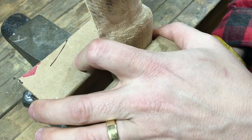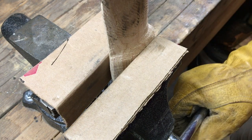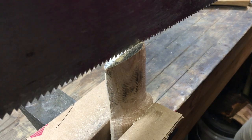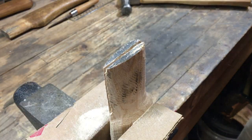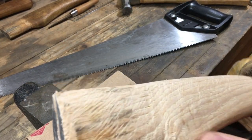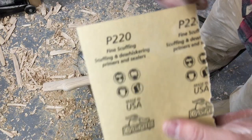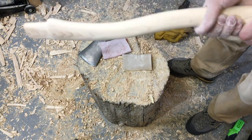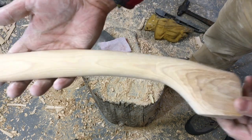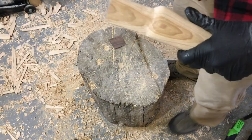After scraping it, it was time to cut the kerf cut for the wedge. I clamped it in my vise and went at it with a saw. It's important to try to keep this as straight as possible so that it lines up with the center and follows flush going down. I have in the past gone a little crooked on one side or the other, and it ends up affecting how the head sits on the axe. If your kerf cut slightly goes to one side, as you pound that wedge in it will turn the axe head away from that side. So it's important to try to get it as straight as you can.